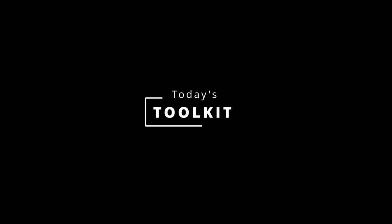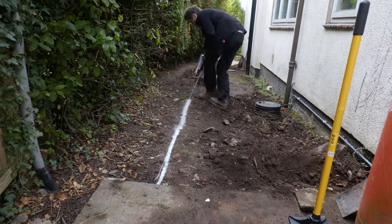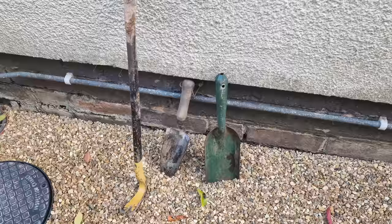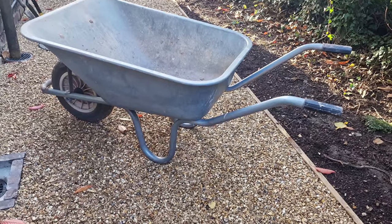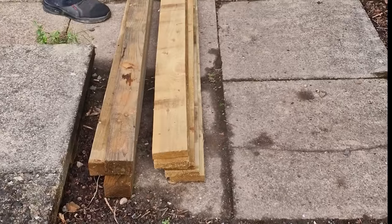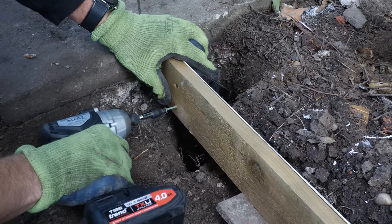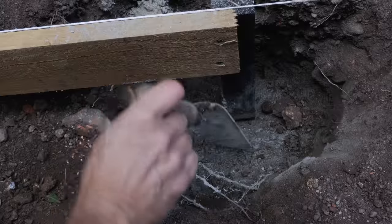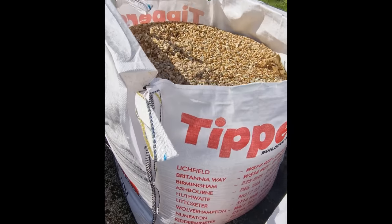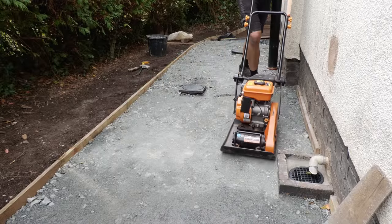Let's have a quick look at today's toolkit — details of which will as usual be in the description below the video. I've got string and tent pegs, line marker spray, a couple of spades, a mattock pick and my Roughneck Mutt Pro digging tool, a gorilla bar and a couple of trowels, my trusty wheelbarrow with its non-puncture wheel — get one of these if you haven't got one already, it's game-changing. Also a Roughneck 10-inch soil tamper, 100mm gravel boards and 3x1 inch tanalised timber, bituminous paint, decking screws, quick-setting post concrete, reciprocating saw and SDS drill, MOT type 1 sub base, 10mm golden gravel, sharp sand and gravel mesh grids. And a cameo appearance from an Evolution Hulk wacker plate.